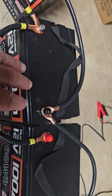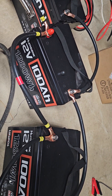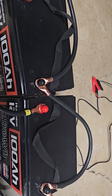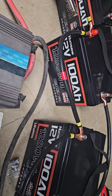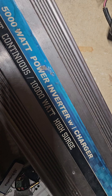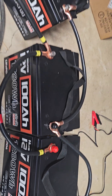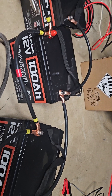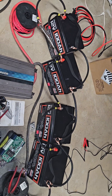So if I took these out and put that 24V in there along with these 12s, the 24 would take all the charge — there's a good chance it will never reach the two 12s. Right now this inverter is charging those at the same time. It's probably not the best thing because this is an old inverter and it's probably not going to charge lithium as well as the newer ones, but you can't beat the 5000 watt with a surge protector and charger built in. It will probably end up powering off the 12V lithium battery charger. The bottom line is it's got to be 12, 12, 12 — or just 12, 12. It can't be 24, 12, 12 because you're going to screw up the charging and end up ruining your batteries. It'll take a while, but you'll do it.